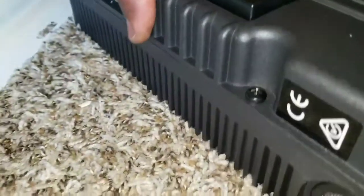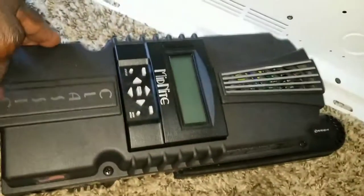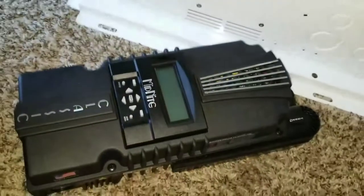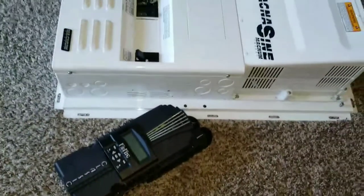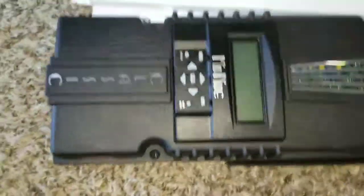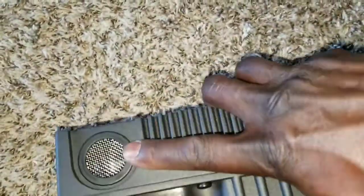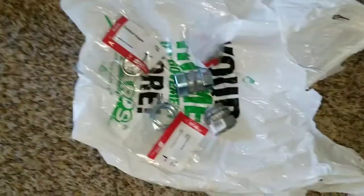So this is how it's gonna look. I'm gonna take this knockout on the corner and put a nipple there, and that's gonna be holding this device right here. Today I'm not gonna mount it — I'm just gonna show you what I'm going to do, because if I want to mount it, this thing has to have a support to hold it on the other side, or else it's gonna be swiveling back and forth. It could fall apart or damage the charge controller, since this side is cast metal.